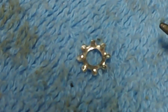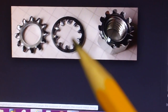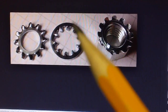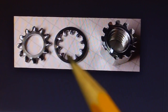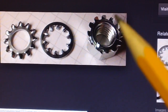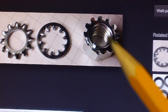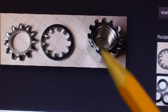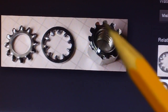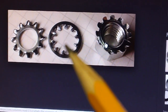Let me show you what an internal looks like. There's the external I just showed you with the teeth on the outside. This is the internal star washer — some people just call them outside and inside. On this nut right here you'll see an external, and it's all part of the nut. There's a little flange they have there — when they make them, the star washer is all part of it.